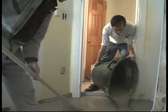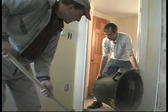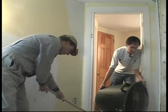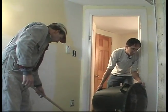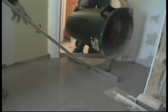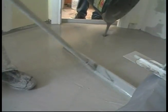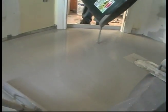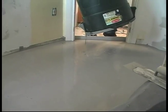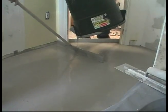It's almost level, isn't it? And you just kind of guide it along here to get it up to level, don't you? Right, we're trying to get an even fill around the nails, which are our guideline. We've accepted the fact that some of the nails may be left standing a little proud, but we'll make them parallel, which will be level.